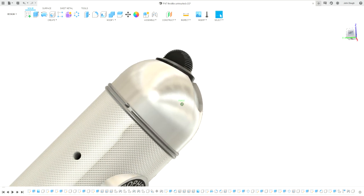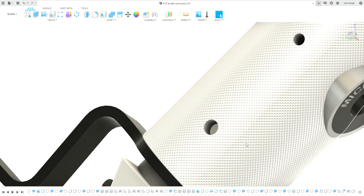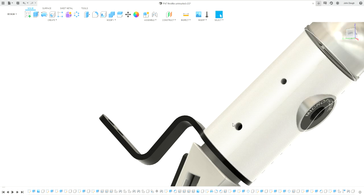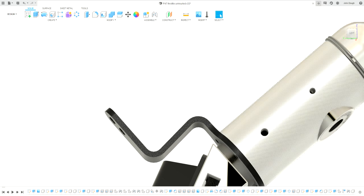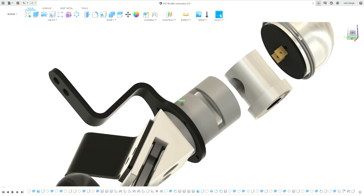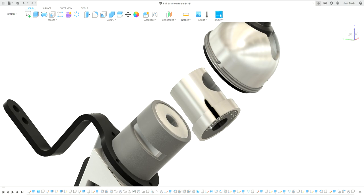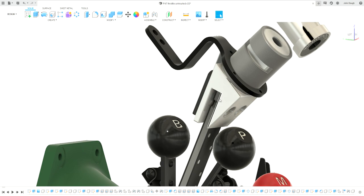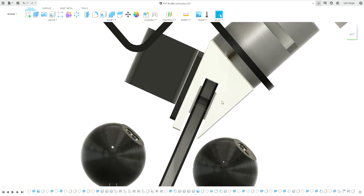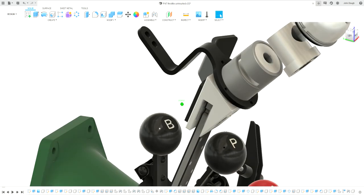I've machined this cap — it's quite a fiddly and thin part, very nice. The knurling doesn't come all the way down; I did do the knurling in 3D but it just completely overloads the CAD. The handle has a little pin that goes in here, various shims, and a slot with a peg that limits rotation. The switch housing has another insulated part that can be engraved. There are several styles — one has a cutout, this rationalized version was made quicker and easier.